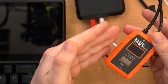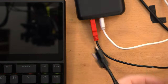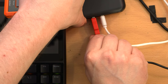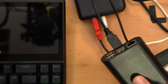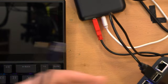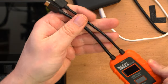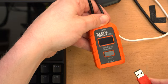I want to take a quick look at the actual power draw of the device over the USB port. The Raspberry Pi couldn't provide enough power — 800 milliamps is not a lot in the grand scheme of things, but a lot of older USB ports max out at around 500 milliamps. This is a Klein Tools ET920 USB meter. I like it because it has pigtails so you're not hanging a USB meter off your USB ports, and it's better for video because I can maneuver it.